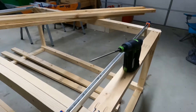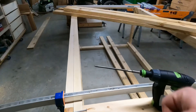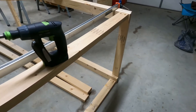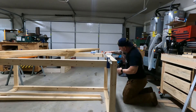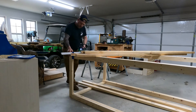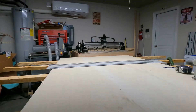I'm going to flip this and do the same thing on the opposite side. I have four sets of pockets on either end on all four corners. I'm pretty happy with the two inch screws — I'll keep those. This is going to be the carcass of the cabinet, but it's a modified cabinet — you'll see in a minute. The track saw is set up and clamped, and we're about ready to rock and roll.